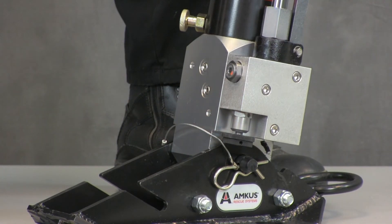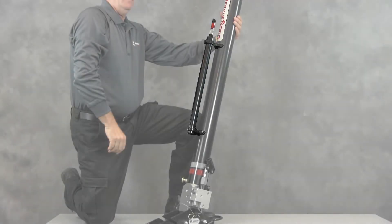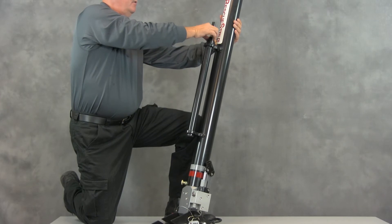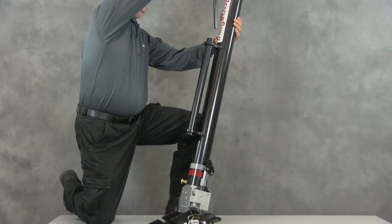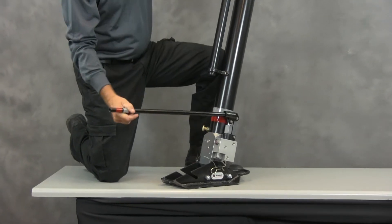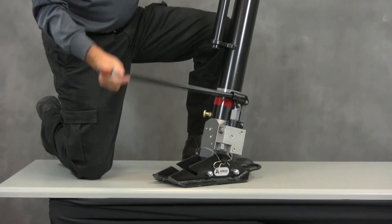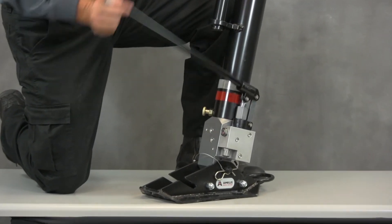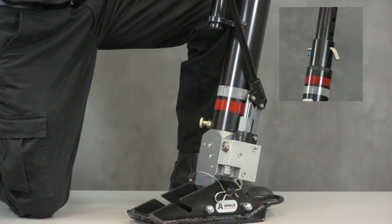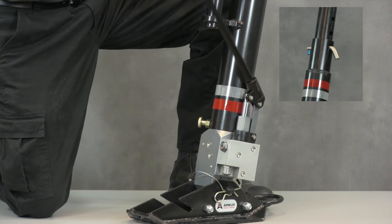For safety and redundancy, the hydraulic lifting strut has dual check valves. The jack handle is stored in the strut's carrying handle. The handle, which will bear up to 115 pounds of pressure, bends at 117 pounds to ensure against system overload.